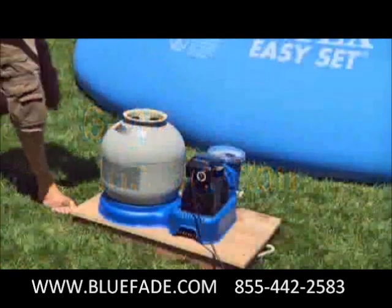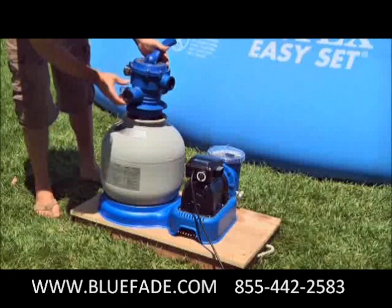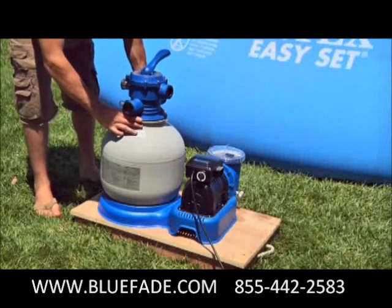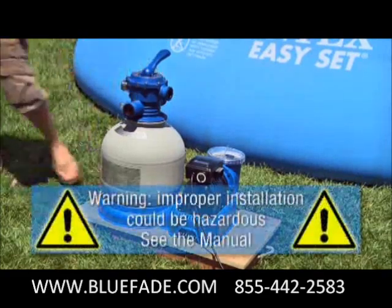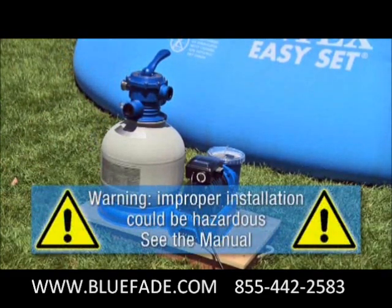Lower the 6-way valve slowly onto the tank, ensuring that the bypass pipe under the valve fits securely into the center pipe. Improper installation could be hazardous. Consult the manual carefully during setup.